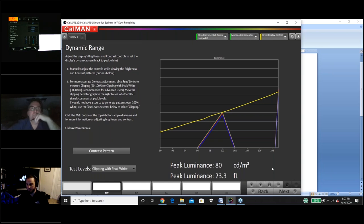And that's one great thing about these projectors and flat panels. Regardless of the room lighting you're in, there are plenty of gamma adjustments on the latest displays. I started calibrating in 07 or 08, and back then there were displays that didn't even have a gamma adjustment. It was based on the picture mode, and if it wasn't what you wanted, oh well. But displays now are so much more advanced. With the PVA, we're recommending 2.4 in a light controlled room and 2.2 in an ambient room or even for television broadcast. Absolutely. Great call.